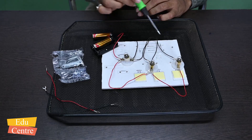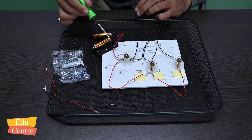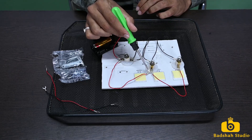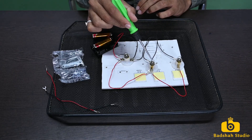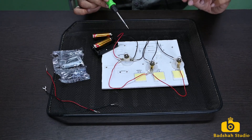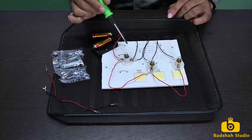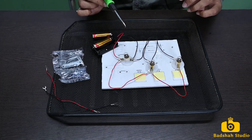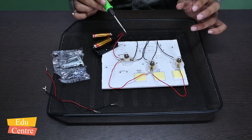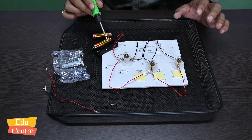For the current to flow there is more than one direction. The electric current coming in will go into one bulb and in parallel also go into the other bulb through a separate wire. This means there are multiple paths for the electric current to flow. In series connection, current could flow through only one path; in parallel there are multiple pathways. So if one part breaks, the current will still flow through the other parts, and the other bulbs will continue to glow.